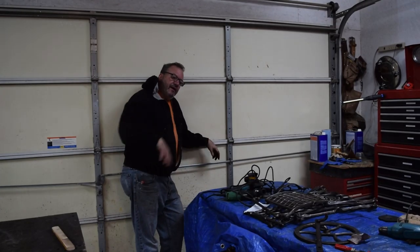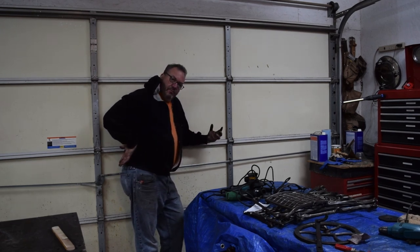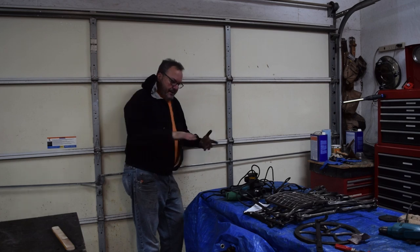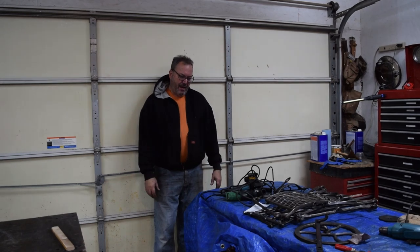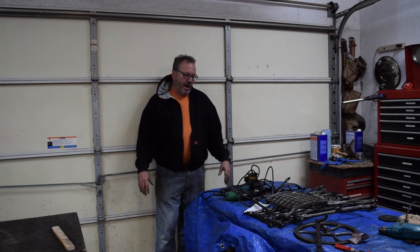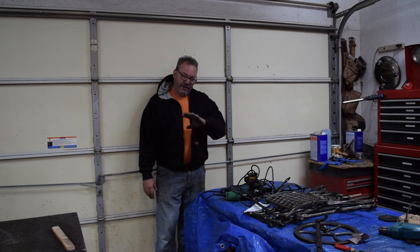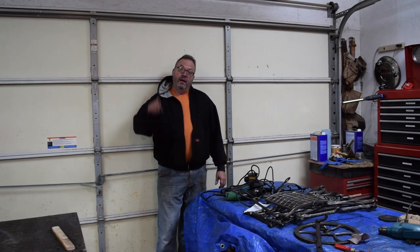Well, that's it. All the cast iron has been wire wheeled off. I used both a braided cup wire wheel and a braided, I don't know what you call it, the flat one, to get into all the nooks and crannies. Came out very well. I'm happy with it. In some places the paint was thick and very hard. In some places the paint was effectively gone. There was a lot of rust in the lower portions of the machine, but it's all been wire brushed or wire wheeled off. It's all clean cast iron now, so we'll get that cleaned up by the next time we're back in the shop, and we'll get it painted.